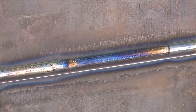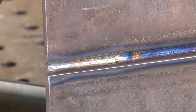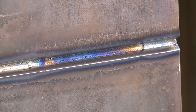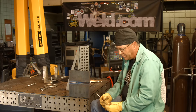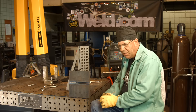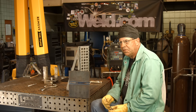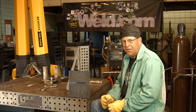I've even run 5/32 on there but with a bigger gap. You're going to get a bunch of different fits — what you don't want is something slammed completely shut; those are super difficult. I'd rather have it a little too wide than slammed shut. I like to run 1/8 and 5/32 wires depending on the thickness of the plate or pipe. I hope this helps — get a hold of me if you have questions. If I can do it, you can do it. Relax, be cool about it. Thanks for watching weld.com — please subscribe.